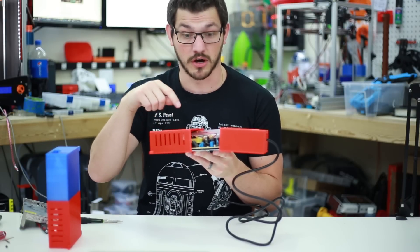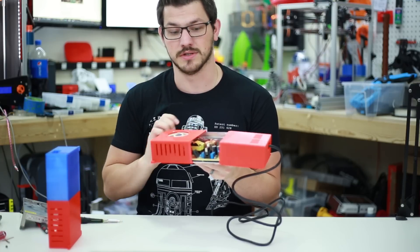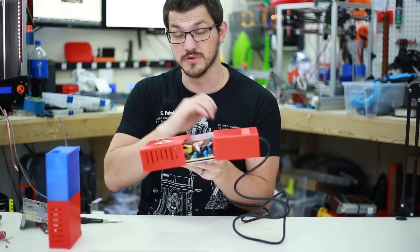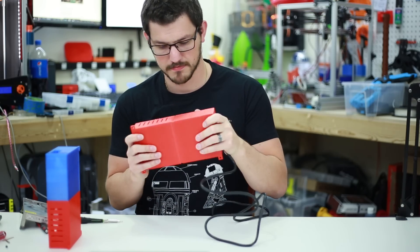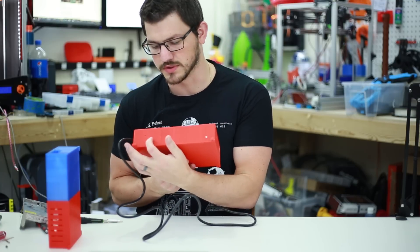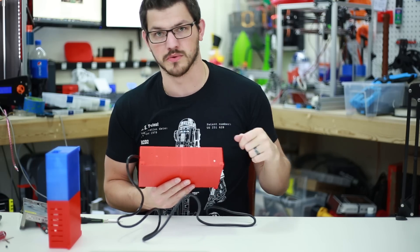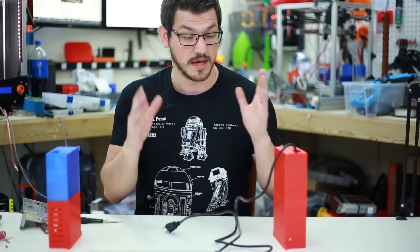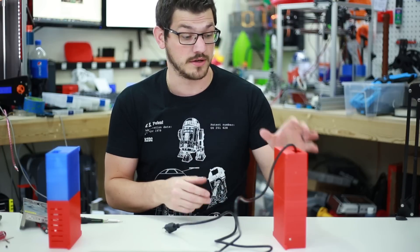There's another, not quite as big component, directly underneath the fan, which is why you're limited on space. But using this case gives you a couple of extra millimeters so you can use a 25mm fan and it works out just fine. The case just clips together and you put your two screws in the side. This version has two holes because I actually drilled it to map out where to put the holes in the final version. This is a pretty quick video — I just wanted to show you how you can get a 25mm fan inside your Ender 2 power supply.